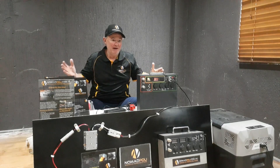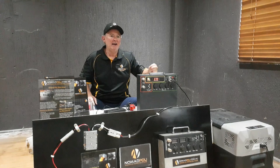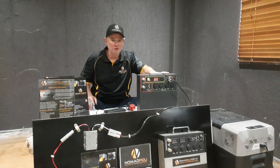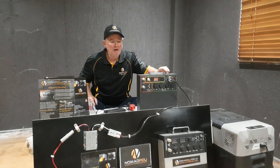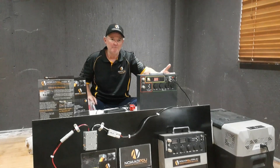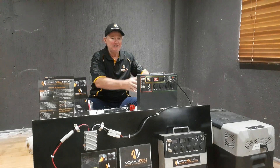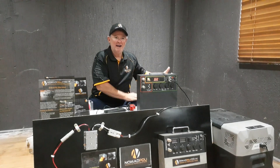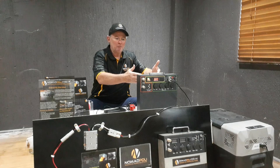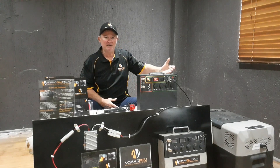A 100 amp-hour battery at 80% depth of discharge — that means you've got 80 amp-hours usable from the battery. Why do we set it at 80%? Because 80% gives you more life cycles. If we set it at 100%, we'll go through the battery quicker and you'll be replacing them more often. So at 80% DoD on a 100Ah battery, you've got 80 amp-hours usable, though recovery rates on lithium will give you probably 90.